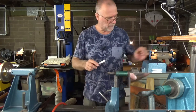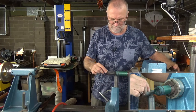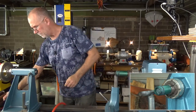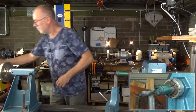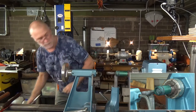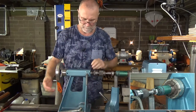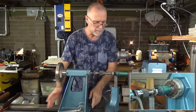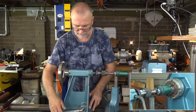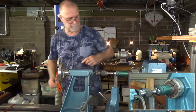should be good. Right, I'll just check that depth there. Yes, we've got to go in more yet. So I don't know how I didn't get that depth right. I didn't think it looked quite deep enough. So we'll slow that down again. We'll put this back in, and we'll bring it up. Bring it back to. Oh, that's why, because I never reset it when I took the initial cuts. That's why. Right. So we'll get it this time.